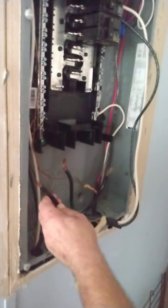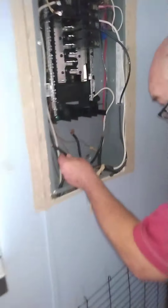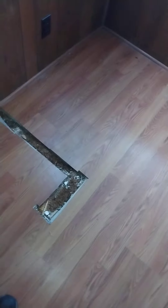That's a 65 to 80 amp panel, but it's copper so it'll carry a little better. Now my video shut off so I have to walk through the whole place again. The odd thing is this is not a name-brand panel — why did they put it over carpeting? This is like a sub-panel, and they put this floor over carpeting. It's taller than it's supposed to be, that's why the door rubs right there.